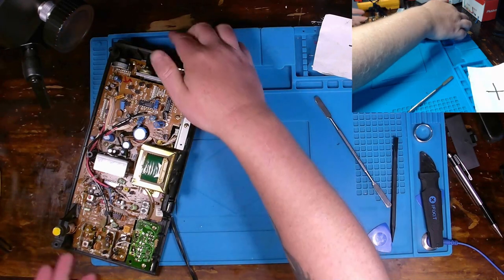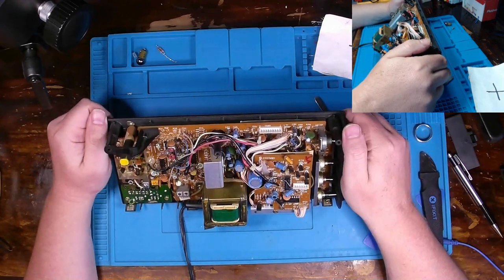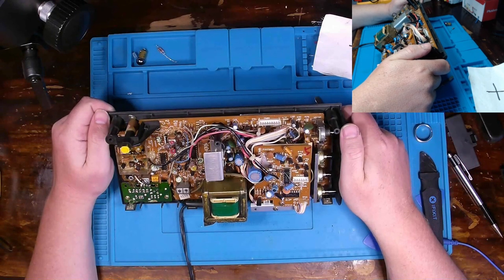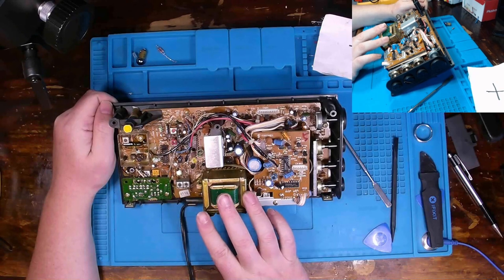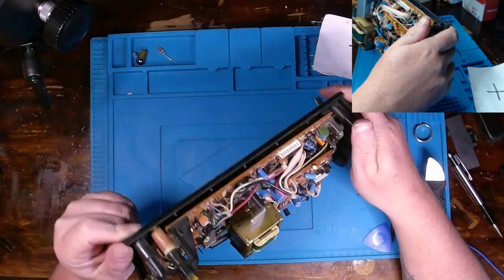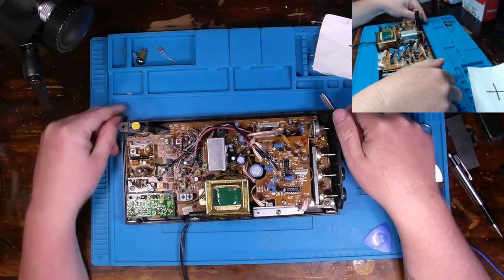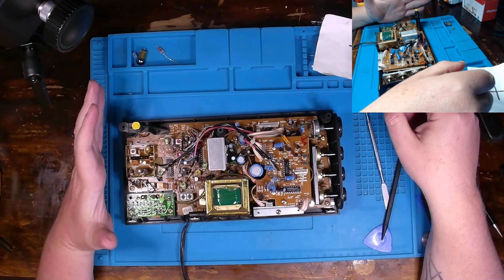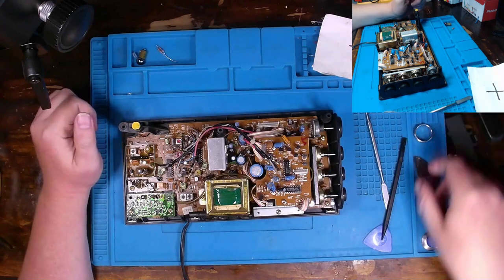And as suspected, we do have a transformer in there, and that's probably why I was getting a fairly low impedance measurement, or I should say DC resistance measurement, across our primary on this power transformer. The secondary looks like it's soldered through the board, but let's see, we've got our antenna input here and another antenna here to set up our incoming signal and establish sensitivity.